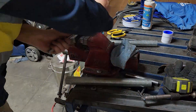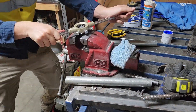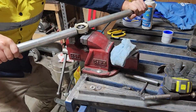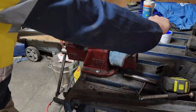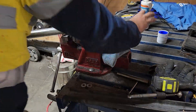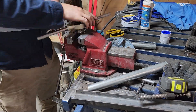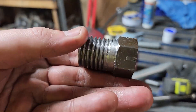I'm not going to lie, this is low effort. I went back and triple-checked the measurement of the shaft — it is below 24mm, so we'll just keep going. I've got these extra bars just to help get a bit more torque onto it, and I eventually make my way down to the bottom of it. I'd like to do a couple of spring passes with the die just to make sure the thread is fully cut.